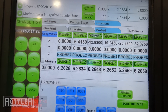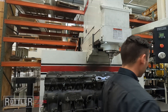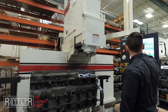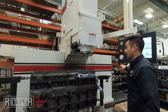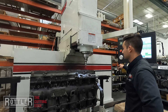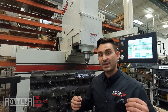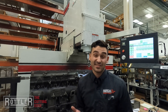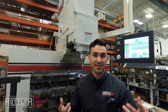I'm going to go ahead and let this probe run — we'll back the camera out and you'll see these all update. We've got our probe in and it's active, so I can go back to the locations tab and hit probe this side. It's going to go and reprobe that first bore. I typically let it reprobe the first bore even though I zeroed on it, because your eyeball center when setting X and Y zero can have a little bit of variance — a couple tenths — so there's no reason not to just let it rerun that first one.